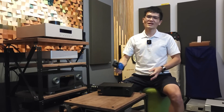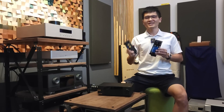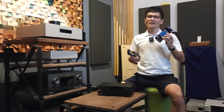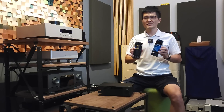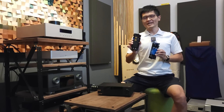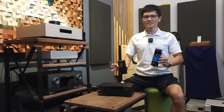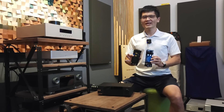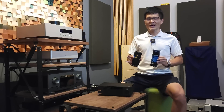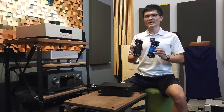This linear power supply can replace the switch-mode power supply in the A6 and be housed in the same chassis — with no soldering required. That's the interesting part. You simply pop the top cover, remove the existing switch-mode power supply, which I have already done. The existing switch-mode power supply weighs probably 50 to 80 grams, but this linear power supply is at least 300 grams, as it uses a transformer and far more components. Remove the switch-mode power supply and install the linear power supply into the same chassis, connect the cable, put the screw back, and you're done.